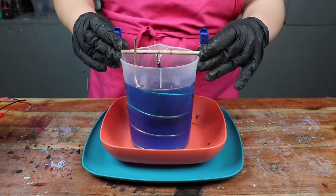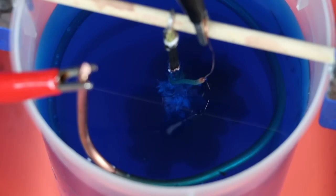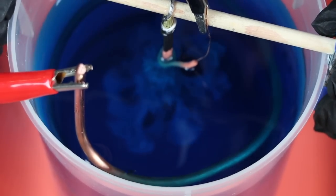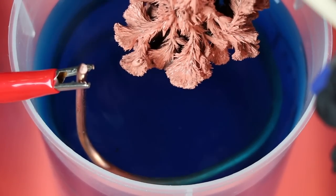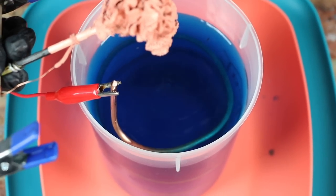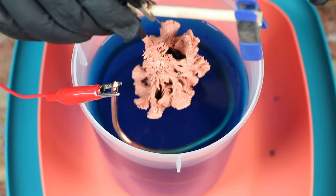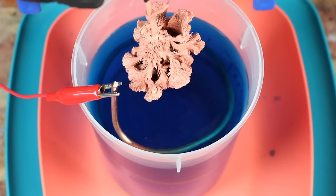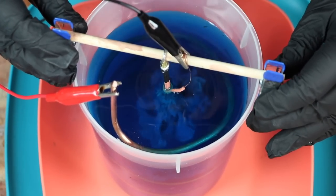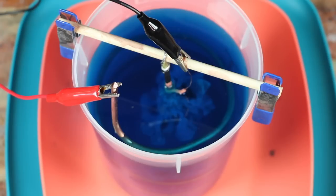Submerge the cathode. It has been four hours and we're going to check and see how it's looking. It's weird — there's still some conductive paint on the inside crevices, and obviously everything is that peachy color and it is not shiny coppery. This is the literal issue that we've been having — I can't get anything to be shiny besides the first thing that we did. Oversaturation of copper ions in the solution from too much surface area of the anode — too much copper coil. It's only been four hours and that's the low end. I think it's the copper coil that we've been putting in.